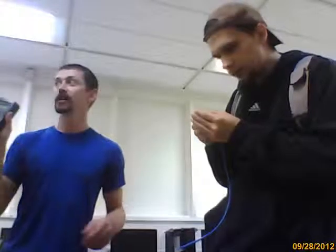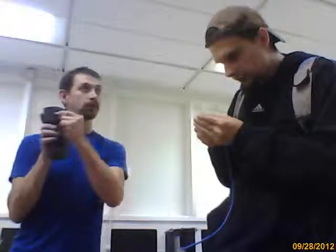And for this demonstration purpose, believe it or not, this is actually very cool, because it gives us an illustration that our cable tester will tell us miswire, and it'll say fail up at the corner as opposed to pass. Instead of telling us the footage, it tells us miswire. And then you know to check your connector.